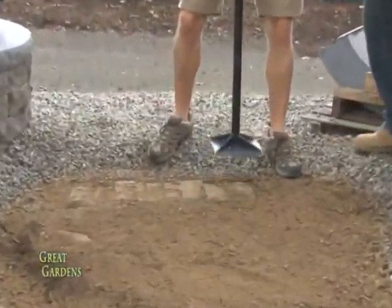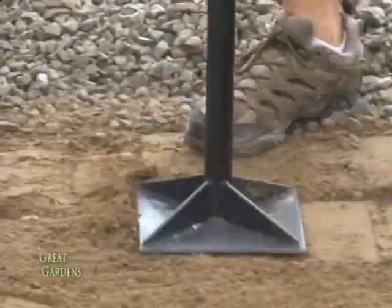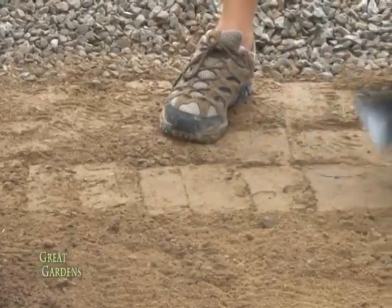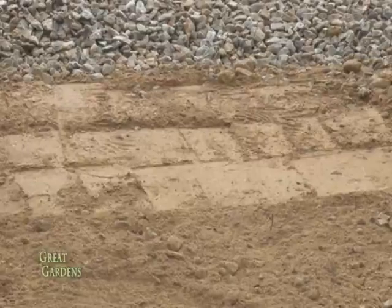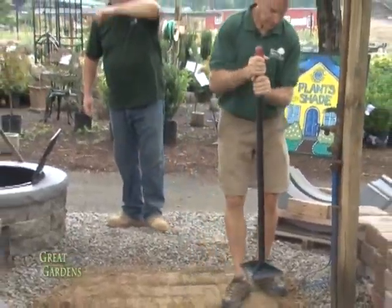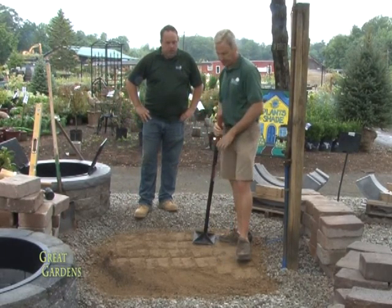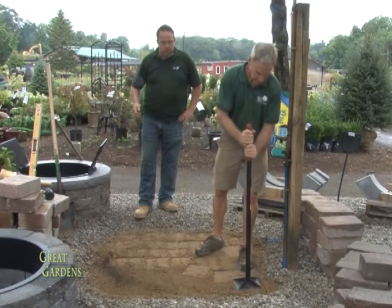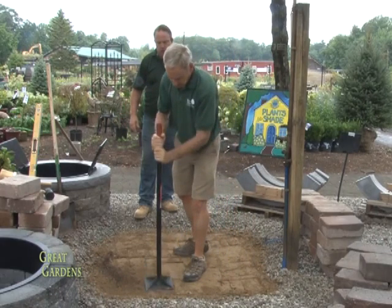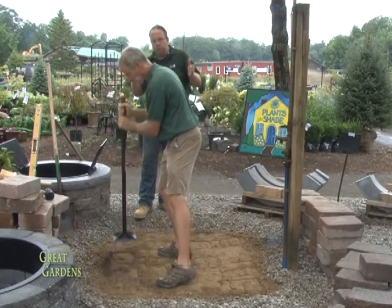Sometimes to achieve a proper compacted ratio, if the material already in place is very dry, adding a little bit of water to it will help with compaction — it helps knit the product together better. This isn't your final layer; we're going to talk about the next layer in a second. It's worth over-excavating the area for a couple of reasons: it gives you flexibility to move things left, right, forward, or back, and you've created a larger surface. That fire pit is sitting on that larger surface, which plays better when water is attracted to the area.